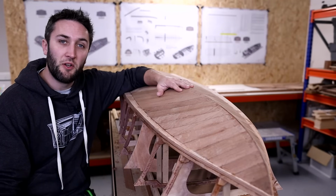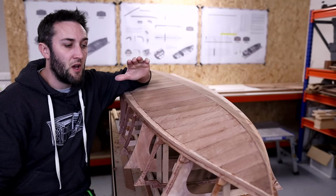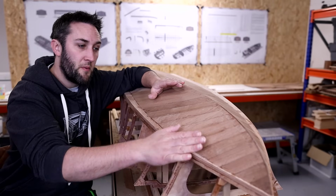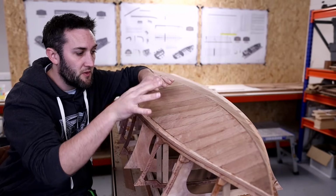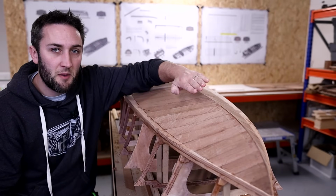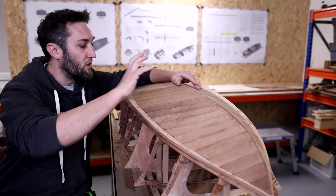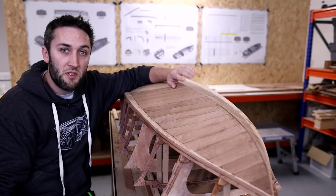In the next video, we're going to look at planking layer two, which is going to vary slightly in approach to this. There are a few things that we've got to do to this layer before we can proceed with the next. We're going to give it a fair off. It's actually pretty fair at the moment, but you've got some highs and lows with little variations in the planks, and we've got a slightly segmented nature to certain parts of this. So we'll give this layer a fair off. We can do a small amount of filling if necessary after this layer.